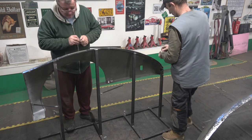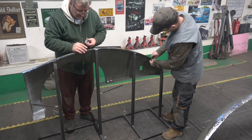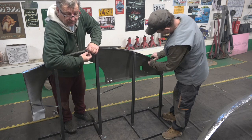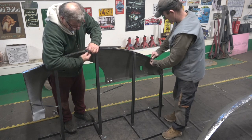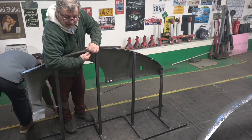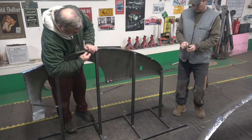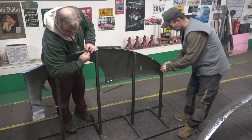And it fits pretty well. I think it'll keep the shape right. Because we've got shape and lead load, and then a little bit of skim of filler, and then the DA on them. But the problem is it's so wobbly, it's very hard, especially when you're lead loading and using the lead file. They're just so flimsy, aren't they? We thought this, it's taken me about 4 hours maybe to make it.